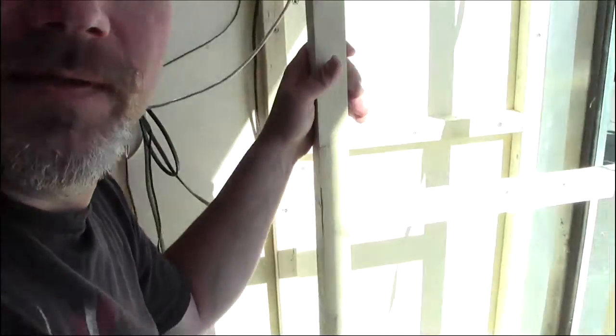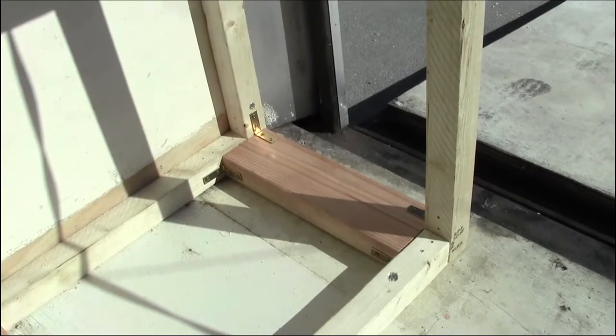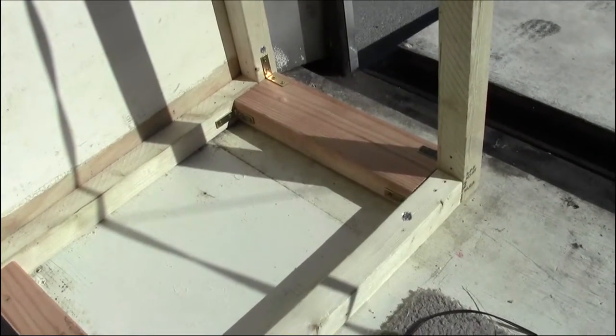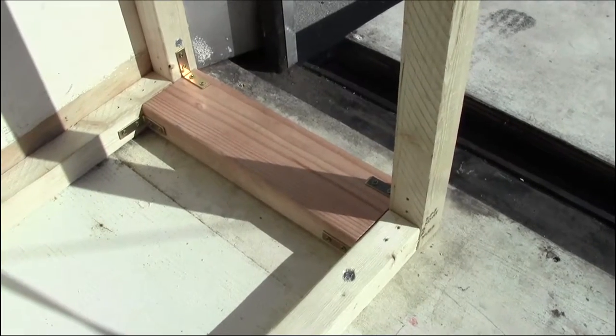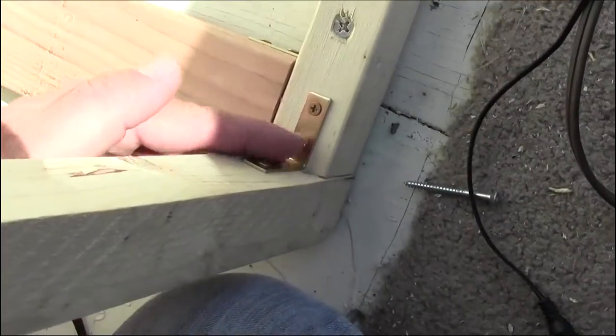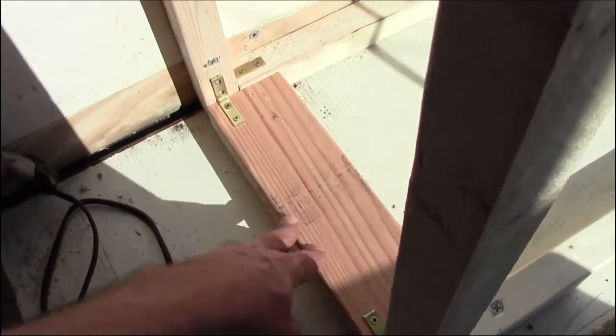One thing about building stuff this way — with the two by two — you get to putting stuff together and then you realize maybe your L brackets are in the wrong place. Also, I used a two by two down at the bottom, which on a cabinet like the one I made for the kitchenette was just fine, but there's going to be a drawer down there. I needed something for the drawer to slide across, so I have to put a two by four down there. I'm having to remove these L brackets because I put them in the wrong spots, and I'm also going to have to put pieces in here to hold the drawers.